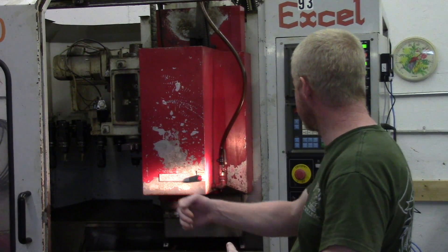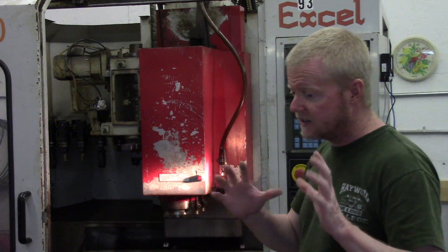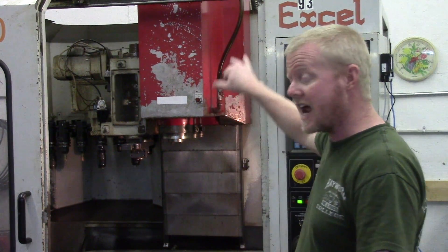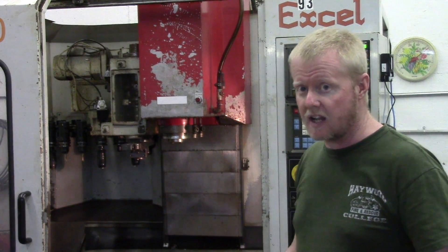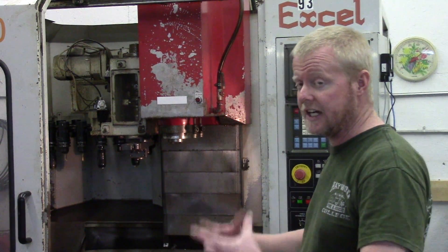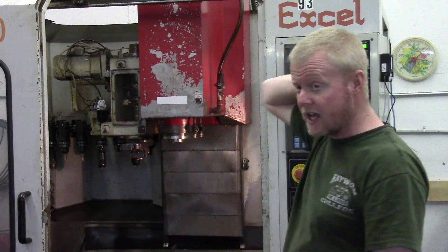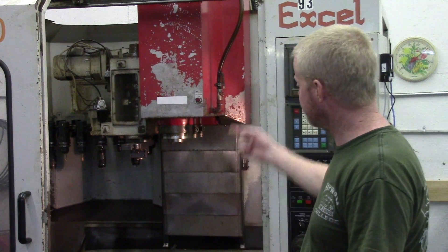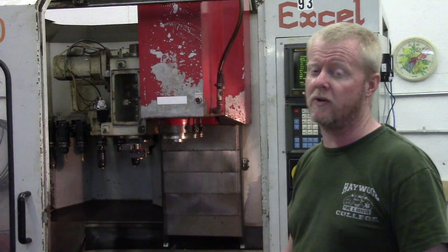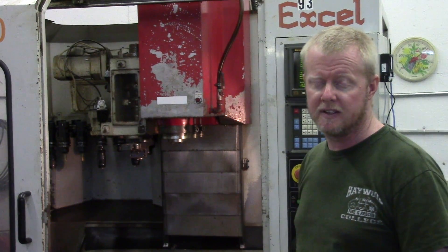This is just some linear moves, some circles, diagonals — that kind of thing. This is what I've been using to test for any major problems. I've already inspected the ball screws on all the axes. They look great and there's not a lot of backlash for how old this machine is. The ways look great too. So all in all, I think the only issue I've got is either a programming issue with the tool changer or something's actually wrong. I'm going to dig around on YouTube and see if I can find another one of these machines and watch its operation to see what step it may be skipping.